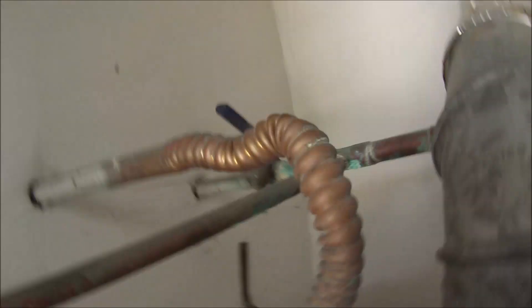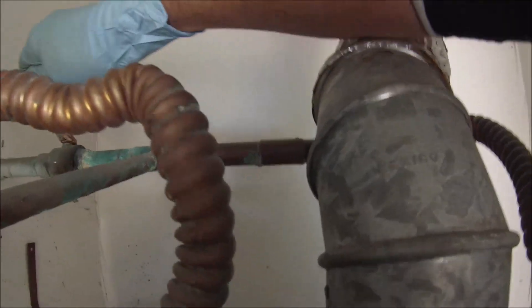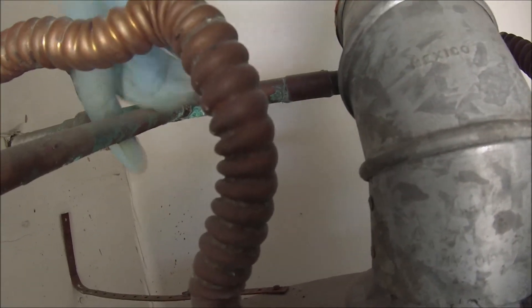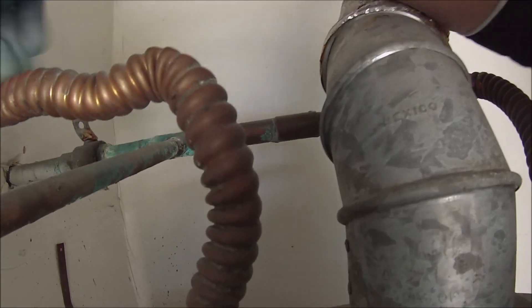I feel like he should have called me out here to take care of this mess — look at this. There's a hose bib that's been teed off the cold line after the shutoff, and it's leaking somewhere. I've got my favorite copper supply lines. You should probably do SharkBite, fresh shutoff all the way to here, then do a tee back in here prior to the SharkBite, and then go stainless steel supply lines.